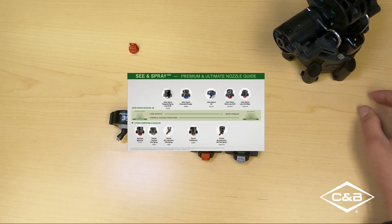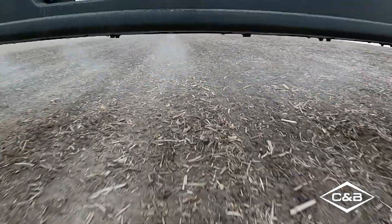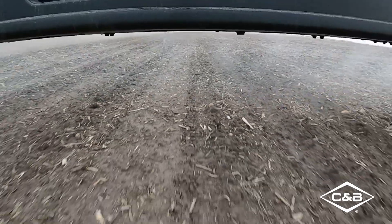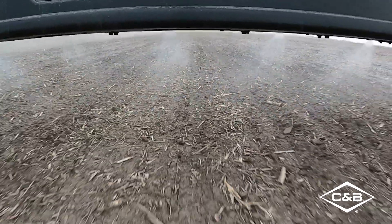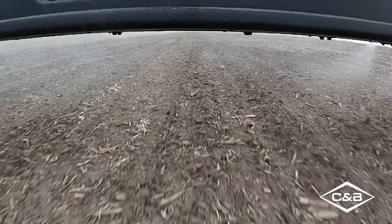There are other approved nozzles as well. We've got, approved this year, a new TSL80 or Targeted Spray Low Drift 80 degree nozzle. You'll see less overlap with that one because you're going to have a narrower fan angle than you would on an LDM, ULD, or even a 3D type nozzle. A narrower fan angle means that nozzle can hit fewer weeds, so it's going to be more targeted for turning on those specific nozzles.